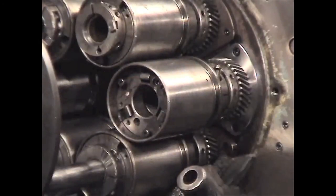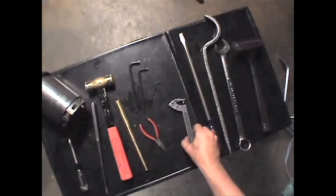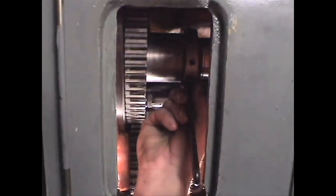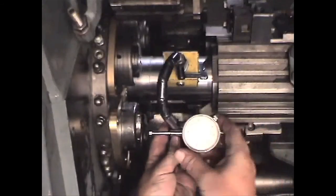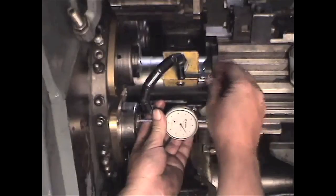Install the spool guard and put your tooling back into the second position. Place your indicator base on the carrier stem and your indicator on the end of the spindle. Adjust your bearing end play using the adjusting nut that holds the gear on and the split nut that holds back the pressure on the rear of the bearing. Set to two thousandths with approximately 200 pounds of push and 200 pounds of pull.